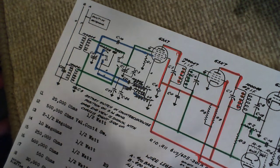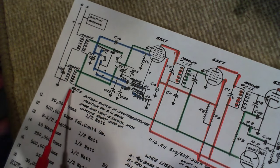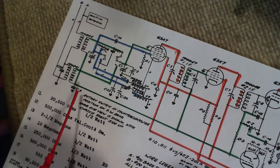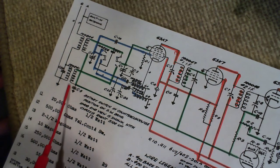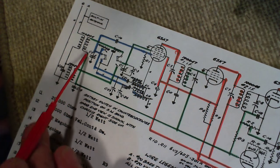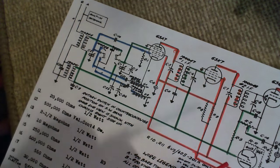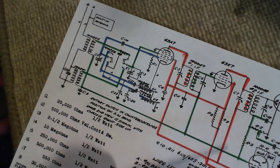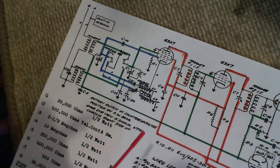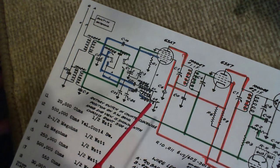In some very expensive radios, this is a variable, or you have a switch, you can select different capacitors and stuff like that. So if this guy's not got the capacitance he's supposed to have, then the AVC voltage is not going to track properly. Again, if any one of these are leaky, it's not good. There's not too many places you can have a leaky capacitor and have it be okay.